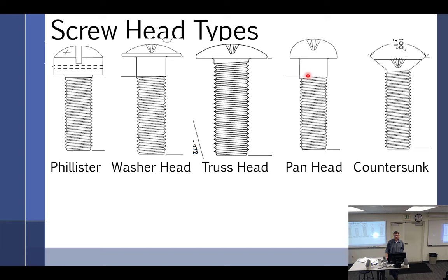So there are screws that are structural, meaning they have the components of a bolt, but they're smaller. Number 10 screws are the same size as what size bolt? 3/16. So a number 10 screw is the same as a 3/16 bolt. If you see any sort of grip area, and this is an observation, then it tends to be structural. Like, I know this is a structural screw right here. So if it doesn't have that flush grip area, does that mean it's non-structural? Probably yes, but not guaranteed. Like I said, it's an observation I've made.